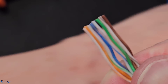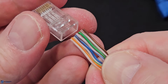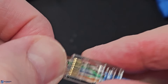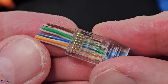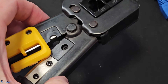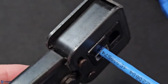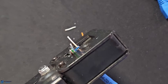And because this is an easy pass-through connector, the length of the wires doesn't matter. So now slowly and gently push all the wires through the connector until they come out the other end. From here, you can validate the color order. If it's correct, it's time to crimp the RJ45. If it's not correct, pull the wires back out, reorder them, and push them back in. To crimp, use the specialized easy RJ45 crimping tool, push the plug all the way through, and squeeze down on the handle until you hear a snap. All the wires on the end should be cut off, leaving you with a perfect RJ45 connection. If all wires are not cut off, squeeze the handle one more time to finish the job.